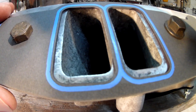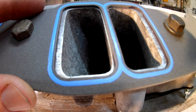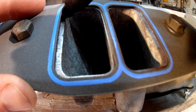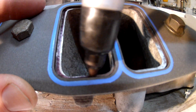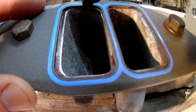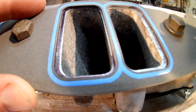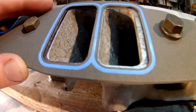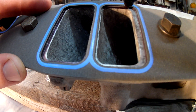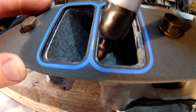I usually just grab a couple of bolts — they're 3/8 bolts — get it lined up, center it up, and go ahead and make my mark. A fine-tip Sharpie marker works. Some people use a machinist's paint or something that they put on and then just scrape with a pick to make it really precise.